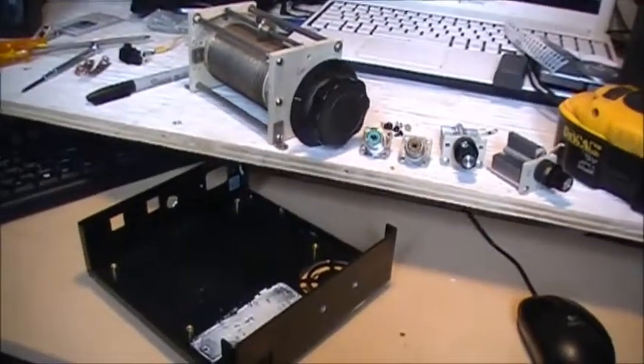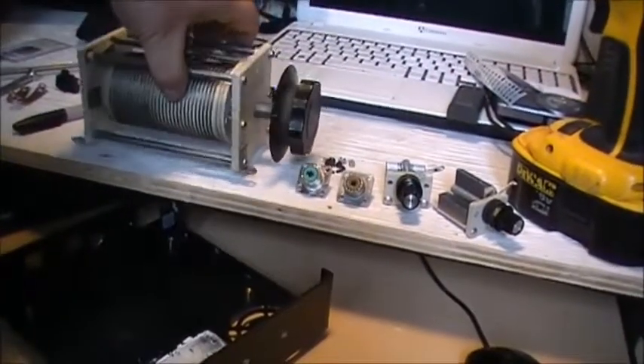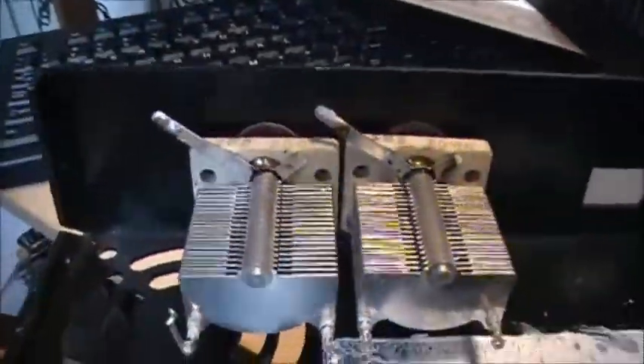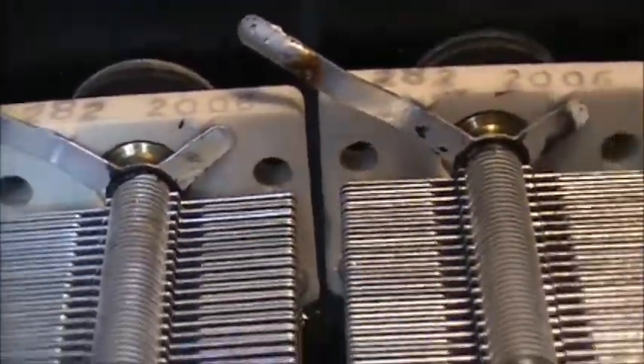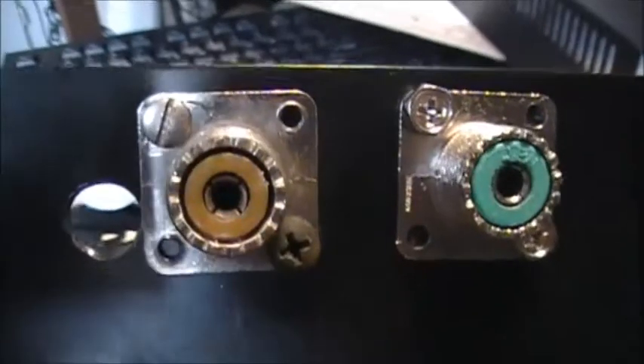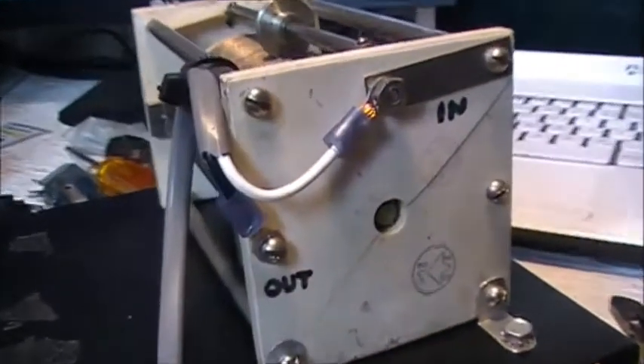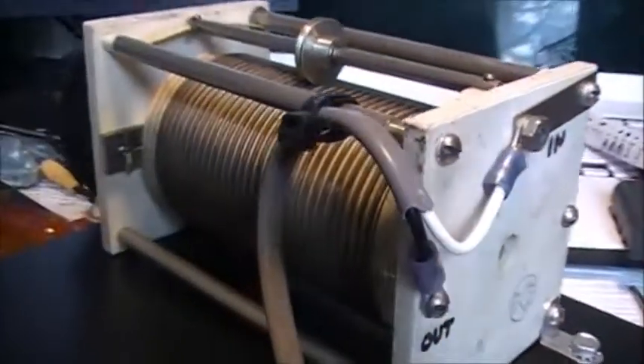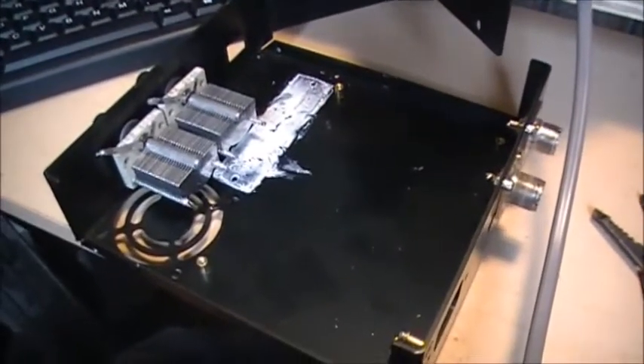So let's see how this little project works out. I've got the two capacitors mounted right here side by side - didn't think much of a gap there between them. I've got the two SO239 connectors mounted in the cabinet, and now I've got the roller inductor bolted to the top of the cabinet. There's my connection points for my roller inductor in and out, so I've got that running down through the top of the cabinet with the rubber grommet in place, and then that's going to connect to the internal parts of the tuner.